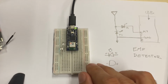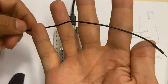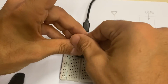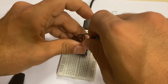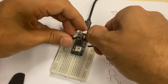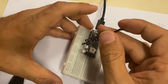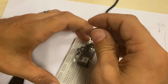Now what is missing is an antenna. These cables are about 20 centimeters. And now to experiment with which antennas detect which frequencies and perhaps which locations of your house have which kind of interference. If a pencil doesn't give you the results you want, you can try with something thinner. I actually prefer that a little bit, but it can become tough if your cable is very hard. Bend it all the way up. One of the things to experiment could be also that maybe you don't want this shape, you want to experiment with something like this. But definitely, this is a good starting point.